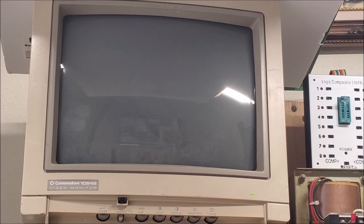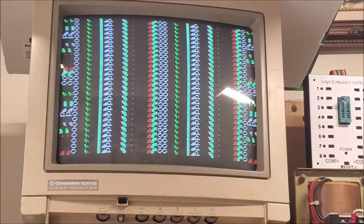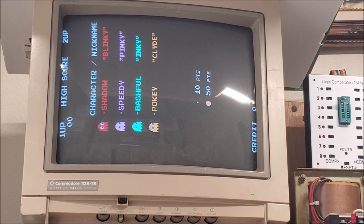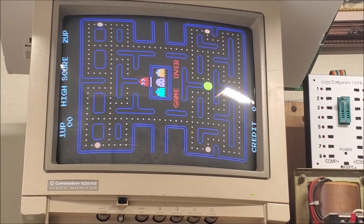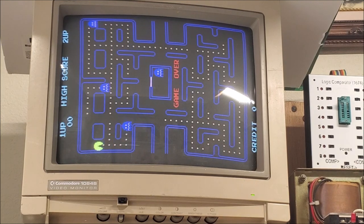Time to put the CPU back in and see how it looks. If it works, we'll strap it down — strap down that card again, the sync bus controller. Very nice. The screen was filled with zeros from just one bad 2114 chip. That's pretty awesome. Looks like all the ROMs are good.